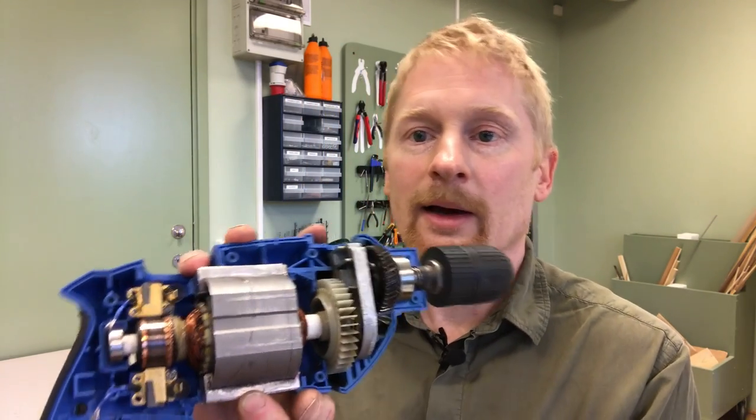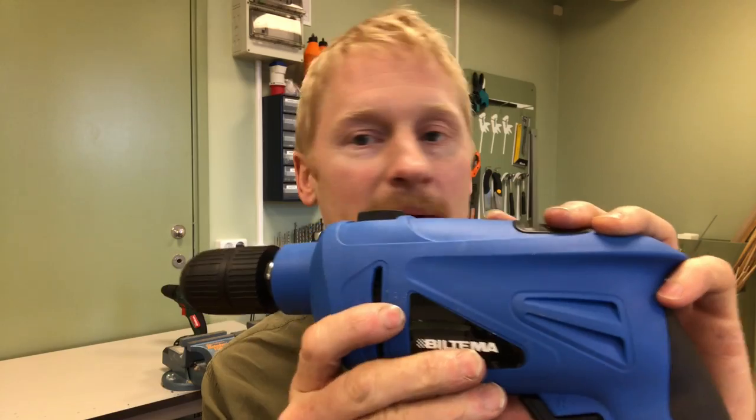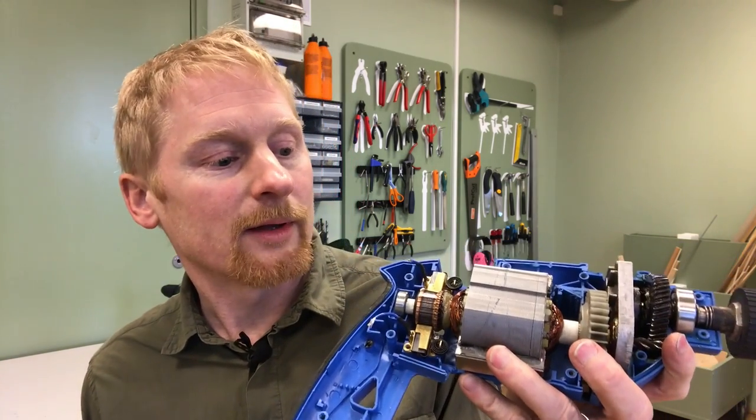The modified machine is around 50% torquier than the original. The strong magnets really help, and the reason the modified machine can consume so much more power is that the rotor windings are originally hooked up to the stator windings in series. The resistance just through the rotor is approximately 20 ohms, while the series wound machine — measuring including the series connection to the stator windings — is about 60 ohms, three times as much electrical resistance. One good thing with replacing the stator windings with permanent magnets is that you also gain a little bit of efficiency.